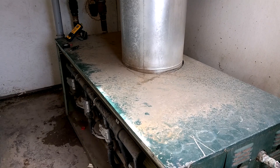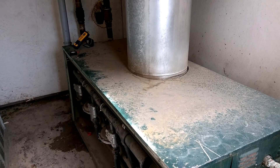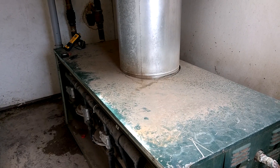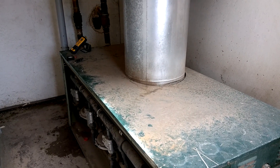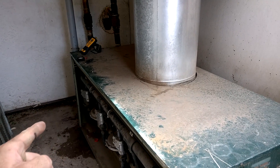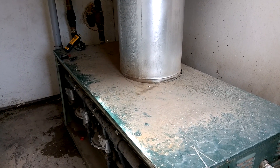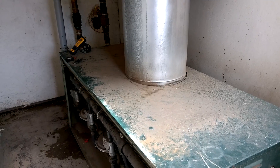The domestic hot water isn't working either. We're trying to find those boilers. This is really strange — maybe you guys have seen this before. I've never seen it before, but they're using the same boiler in the same loop of hot water for both room heating, going to the fan coil units, and for the domestic hot water.